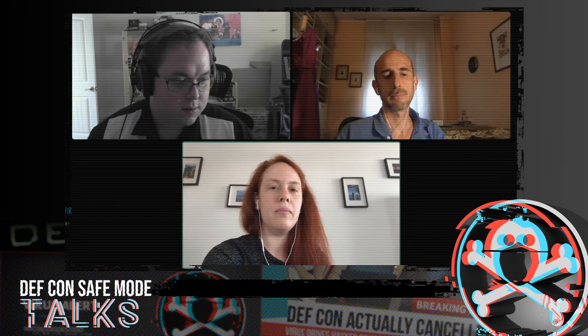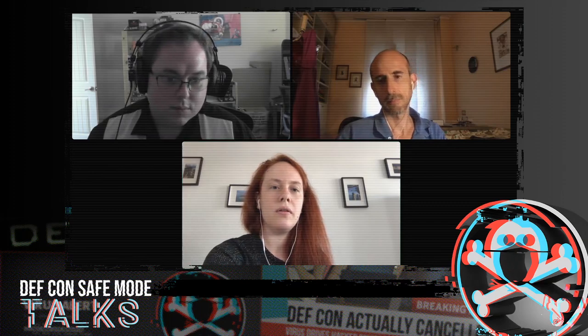A question asks about Frankenstein, mentioned during the talk. Jiska explains it's a project from her former student Jan involving snapshotting and emulation of Broadcom Bluetooth chips. The emulation includes thread switches and a virtual modem that attaches to a Linux host, enabling full-stack emulation including scanning for devices. The paper is already public and the software has been on GitHub for a while, and it was presented at Usenix Security.